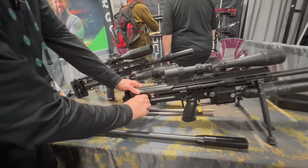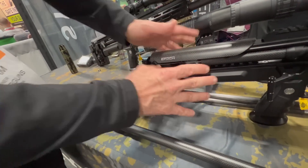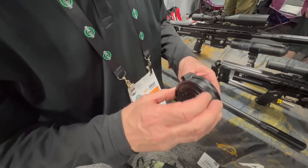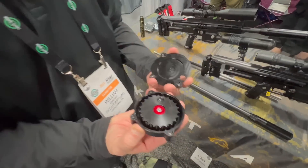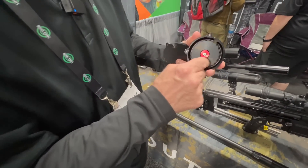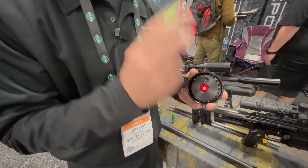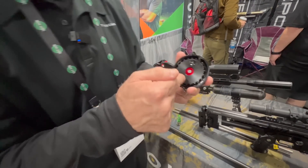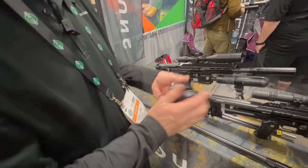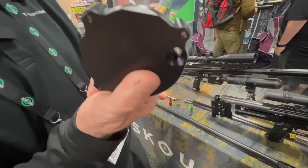Our magazines are quite neat. They have magnets that pull them into place, so they always find the right center. We also have a magnetic cap that holds this as well. We do our stops a little different — we don't put a stop in. We want people to be able to wind at different rates. So a .30 caliber, two winds. But if you wound twice on .177, you start to crush your pellets. Basically you can experiment with it and determine what wind you want to use.